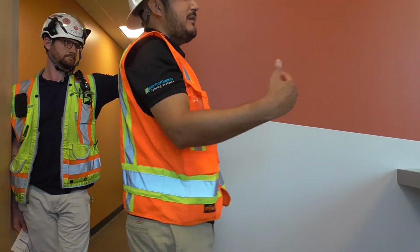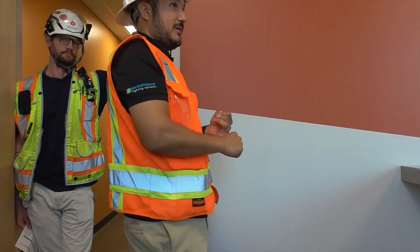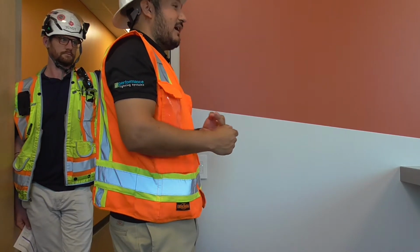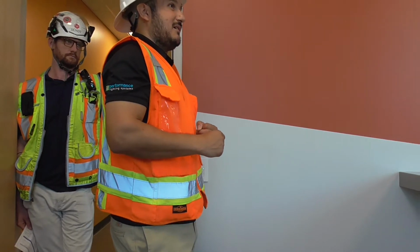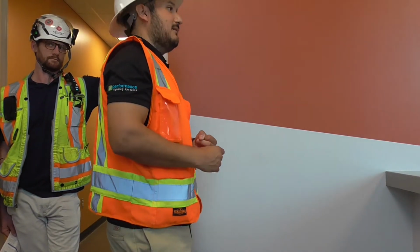Yeah, correct. Because coming on at 65%, that's what we applied. We're applying it anytime the lights come on, either via the switch or the sensor, they come on to a certain light level. We have to set that light level, and the California code is 65%. So if you did want a brighter room, you have to physically press and hold, or you have to reprogram it so that it always comes on at 100%. Right, or 80, whatever you decide.